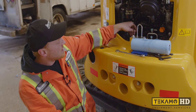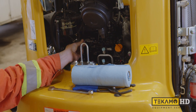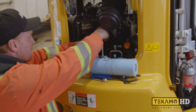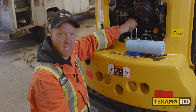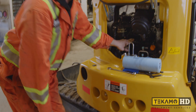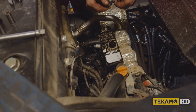We'll start by plugging the injection pump back in so we don't forget later. It's plugged in and I'm going to jump up top, put some glow plugs back in, put the power rail back on and continue on. To start, I'll just drop the glow plugs in.